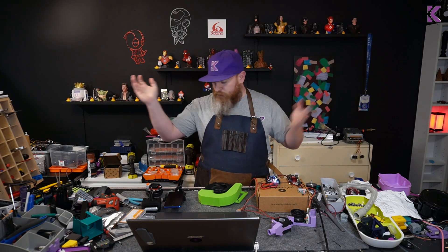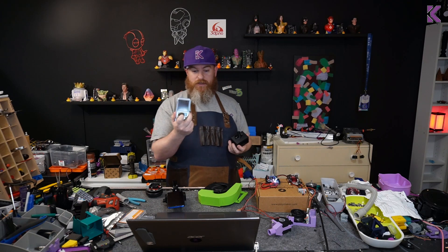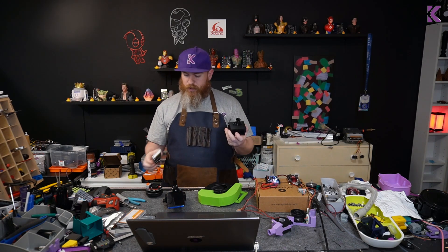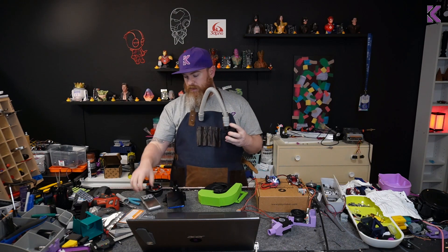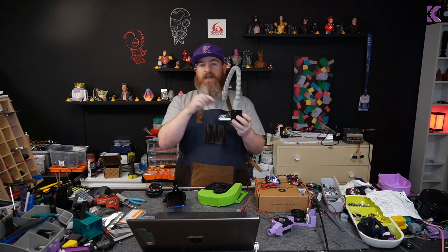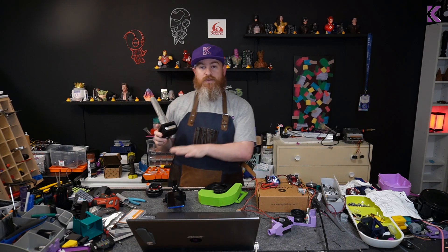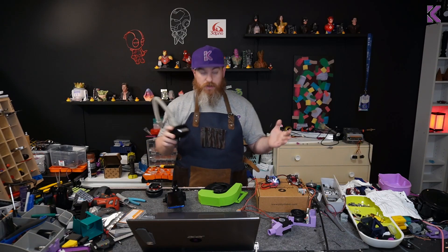So how do I do this? I've made a little jig and I have a jeweler's scale, so it's super precise. I'll put that under this little jig — the sole purpose of this jig is to put the CPAP tube on — and then put the little scale right there. The CPAP will blow onto the scale, giving me a number of pressure. That's not relative to anything else; it's just for this setup, but it would give me a value to compare between all the fans I have right now.